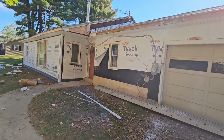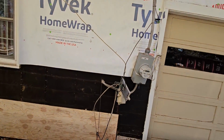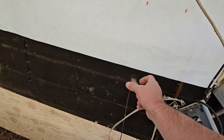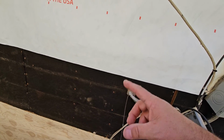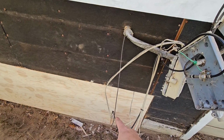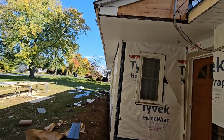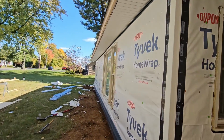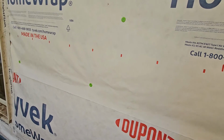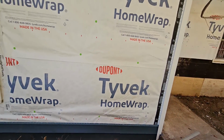So this is how we set up paper. This is how we set up light blocks. And also you'll see these openings here. Once we have the paper on, we'll tape some flex tape. It looks similar to the stuff we put around the windows, around any of these openings down here as well, where there's a hole in the siding, where we just want to make everything airtight. So we're taping it, sealing around any openings, and we cap nail everything with the Stinger nail gun, 1-inch nails to hold the paper. And that's pretty much it.